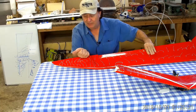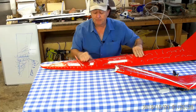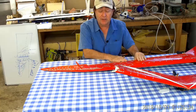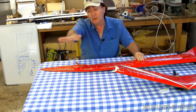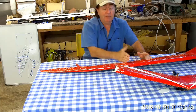Winglets inboard, control surfaces inboard. You might be thinking: can I just put ailerons out here and put the elevator inboard? Because you're talking about up elevon when flying slow in a thermal — your elevator is up and you're shoving the flow off the tip. Basically that's correct — you can put the elevator inboard, put the ailerons outboard, and that's much less of a problem.